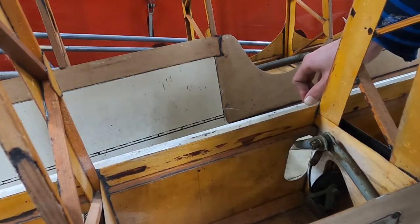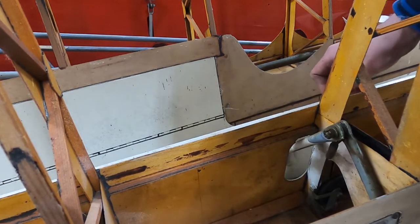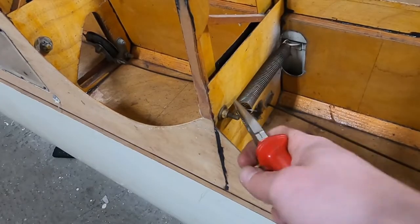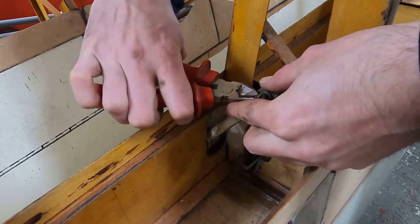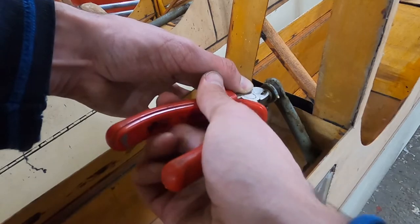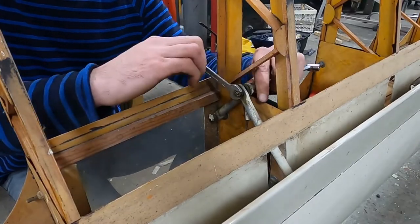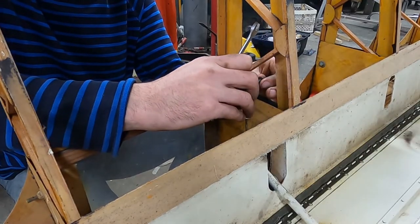The airbrakes tilt upwards and are pulled closed by two springs. A cable pulls on two tubes which push the airbrake open. To make removal easier, we first undid these springs. Every rotating part on this mechanism is held in place with crown nuts secured with split pins. These split pins are great as a security measure, but really hard to remove. It always takes a while to remove them, even if they don't break. But with this done, the mechanism can be disassembled.